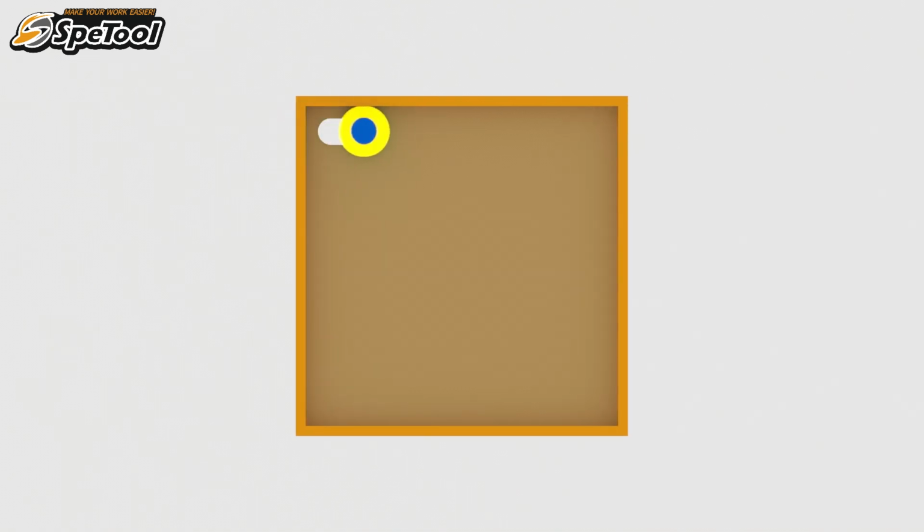Notice how the bush hugs the template, tracing its edge for a perfect cut. Remember, keeping the bushing tight against the template is important. If not, the key will not fit in your mortise. After the bit has made an initial pass along the edge of the template, the red part left is the key. Okay, now let's put the collar back in place to make the mortise.